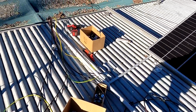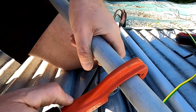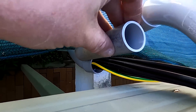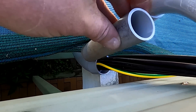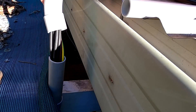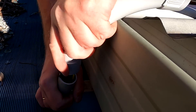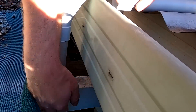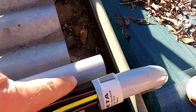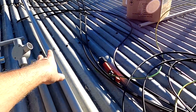Let's do this cabling now because I'm very thirsty. This will be our little riser here coming from the bottom conduit going into this elbow — I hope it's the right length, I'm not 100% convinced. It's a bit hard to reach there so this is more of a guess. I think it fits! There's a bit of work out here with this double bend. Okay, I think it fits — now we put the cable through the straight path to the junction box and we're good.